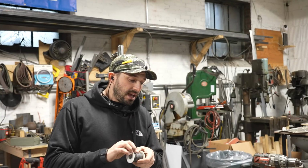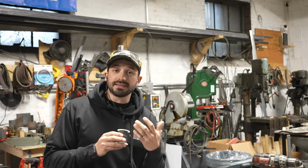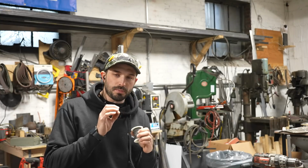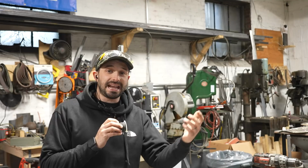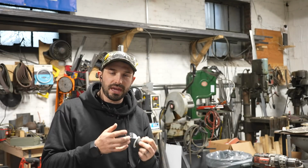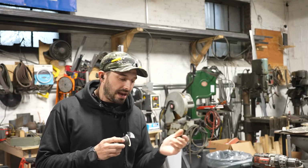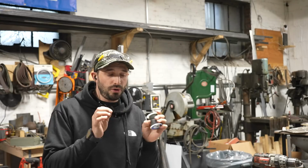Now, for me, these are the types of things where you just want to have the awareness of it in your shop, because every now and then I do a project where I make something with a profile I just can't quite get to with a file, and I need to refine it because I need to hand it over to somebody. I make knives and little handheld things that I want to be soft to the touch, right? So I can't have any burrs on them, and I don't want to sandblast them or bead blast them. So something like a little abrasive cord, stick it through a hole, do a little bit of sanding, can just clean things up a little bit.